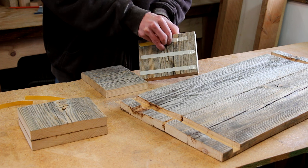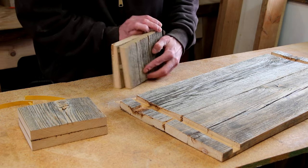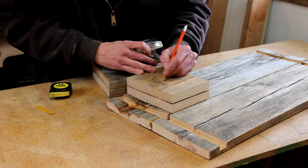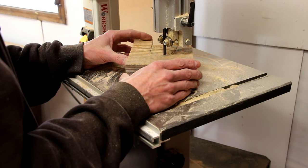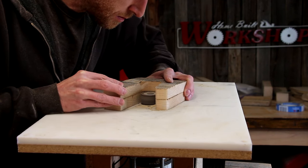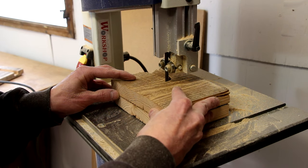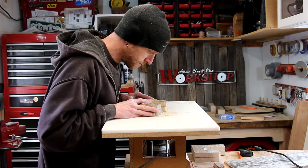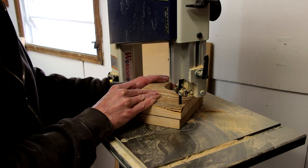Since I'm making two of these, I want the sides to be identical, so I'm going to stick them together with some double-sided tape. Now I'll just roughly draw out a shape that I can cut out on the band saw, and I'll fine tune those cuts with my homemade spindle sander. Now I'm going to duplicate that on the other piece, but I'm going to offset it by about an inch and a half, and I'll smooth that one out on the spindle sander. I just realized I forgot to cut a radius on the bottom of these to make the lines a little bit cleaner, so it's back to the band saw for a quick trim.